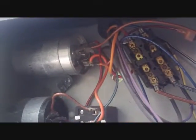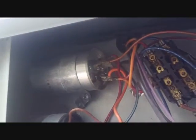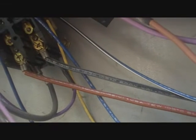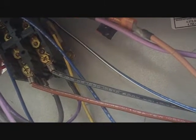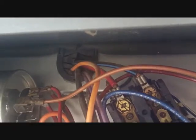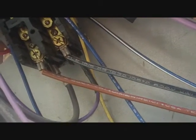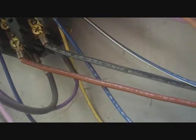Since we had a bad capacitor, always check your amperages on your compressor, fan, or whatever your capacitor serves. This is the indoor blower motor — check that. Use your common wire; that's a common wire for the whole unit or the common side for this unit. And since you can't really reach the compressor on these little Tranes, sometimes you can fish it in there, but mine are kind of hard to fit. You can do this one and just subtract out the outdoor fan motor and it'll give you a pretty fair representation of what the compressor's pulling.